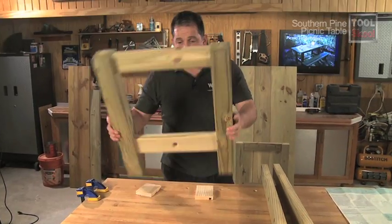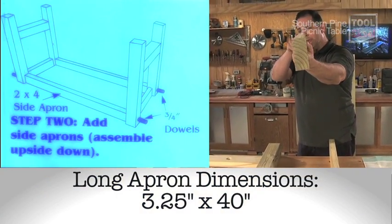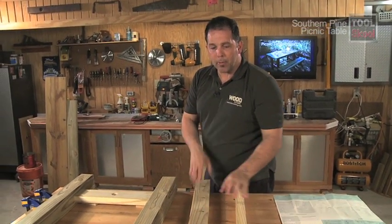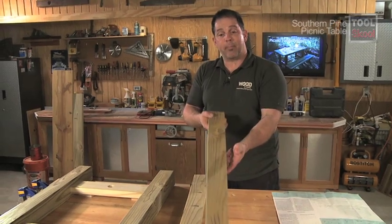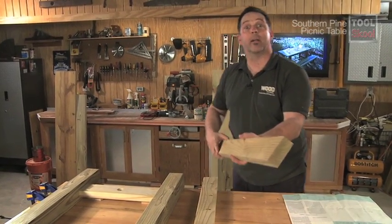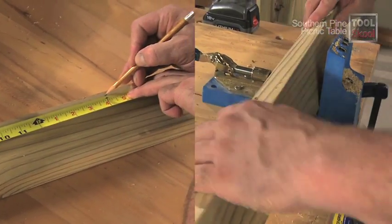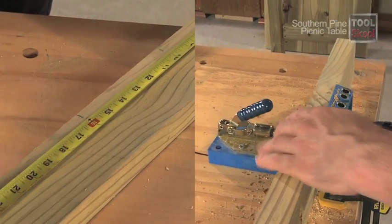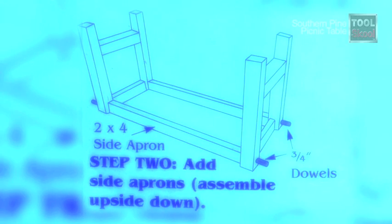Our two ends will be connected by the long aprons, 40 inches long each, with pocket holes in just the right spots. This can be as simple as a 2x4 or a 2x6 like the scrap I found in my shop, ripped down to the right size and sanded smooth. I marked and drilled pocket holes on each apron at four inches from the end, 10 inches from the end, and 16 inches from the end, then made the same measurements from the other end. I also drilled two pocket holes at each end to connect the legs. The next step is to connect the aprons to the end leg assemblies.